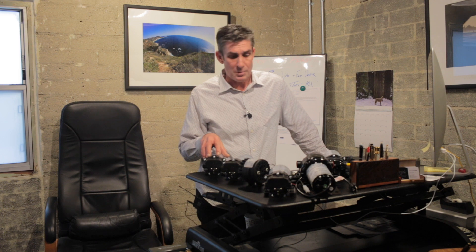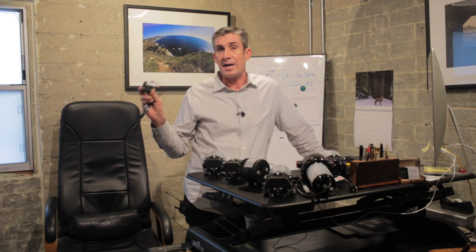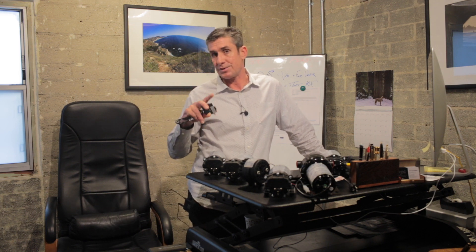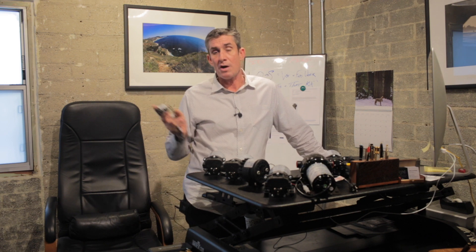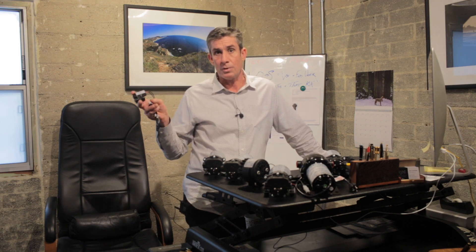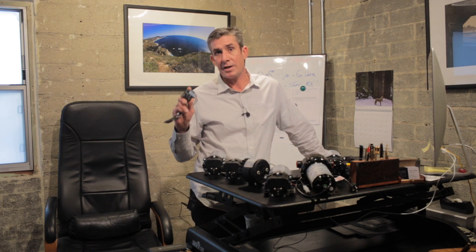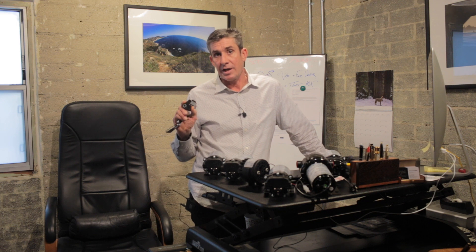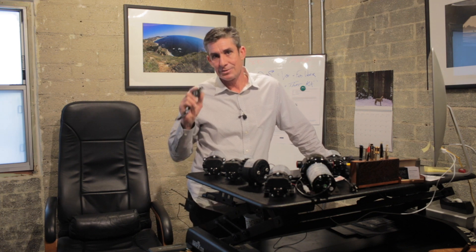You're going to get better quality water and more of it using a boost pump. Quick note on the pressure switch: this gets tied to the tank pressure on your RO system. You don't want to read the pressure at the membrane because it's just going to cycle on and off. Put this on the tank and it's going to turn off your pump when your tank is full, typically at 40 psi. These come preset at 40 psi or 60 psi, available in quarter inch and three-eighths John Guest.